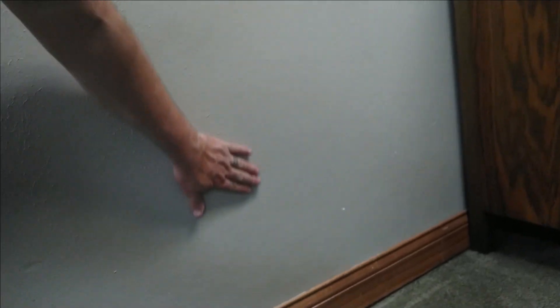One important aspect to note: the wetness on the walls detected by the IR camera isn't behind the wall — the moisture actually has to wick through and touch the surface. As you can see, you can't easily tell there's moisture in that wall just by looking or even touching it. It feels only slightly damp. Hopefully that gives you a good idea of how the infrared camera works in conjunction with a moisture meter to help you solve moisture problems in your house.